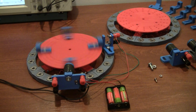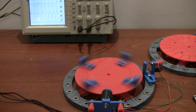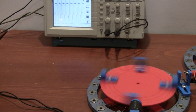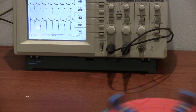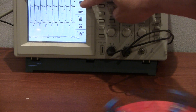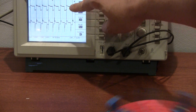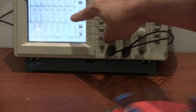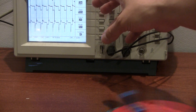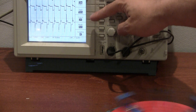If you look now at the oscilloscope, we can see the signals coming off the trigger coil and the generator coil. You can see the trigger coil is producing a square wave signal, and there are spikes being generated on the square waves as they go around. The generator coil on the bottom is putting out more of an AC waveform — it has very powerful spikes that actually go up several hundred volts, sometimes as high as 400 volts as each magnet goes by. This is probably because the magnetic field of the coil collapses every time the reed switch opens, making a big discharge into the generator coil. This may be the effect that a lot of people have been talking about in terms of improving battery capacity.